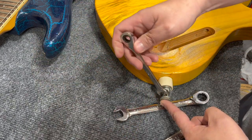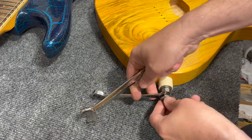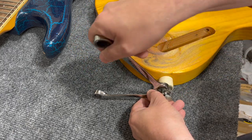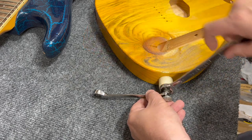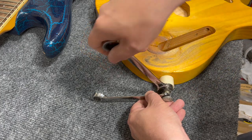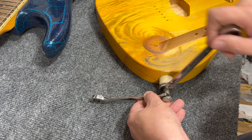I usually use one finger on the end of the carriage bolt while my 3/8 inch wrench slips over the shoulder of the carriage bolt to keep it from spinning. Then my 9/16 inch wrench tightens the nut just behind the socket. As you tighten, push on the end of the carriage bolt to keep the masking tape pushed up against the edge of the body — that ensures you maintain the 3/8 inch distance as you tighten the clip. Taking the slack out of your bolt before inserting the tool will reduce the number of turns needed.